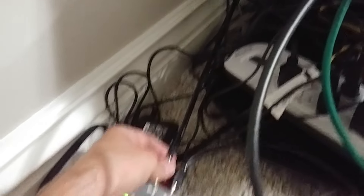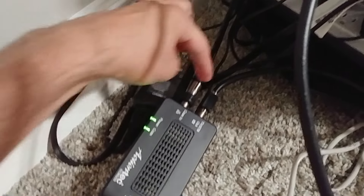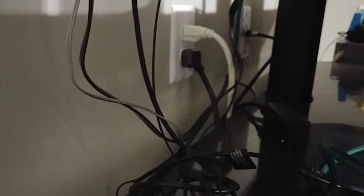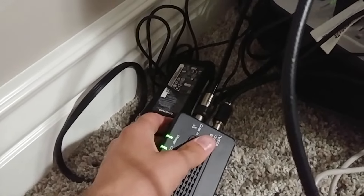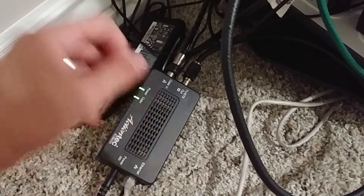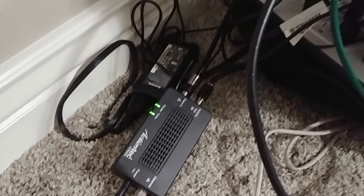So if you had a cable TV box and still needed to use this jack for cable TV, you'd go ahead and plug the coax from the wall directly into the coax-in port, and then that would go to your cable box for your TV. In my case, it's just going to the modem. All we have to do is plug in the Ethernet cable, and that's going into my router. Essentially, we're injecting Ethernet into our MoCA adapter, which is then going onto the coax and back to the splitter on the outside of the house. So now that we're injecting Ethernet over our existing coax with no wiring being run at all, we can go upstairs and look at the receiving end, which is going to look pretty much exactly like this, but going into a network switch giving me physical ports upstairs.